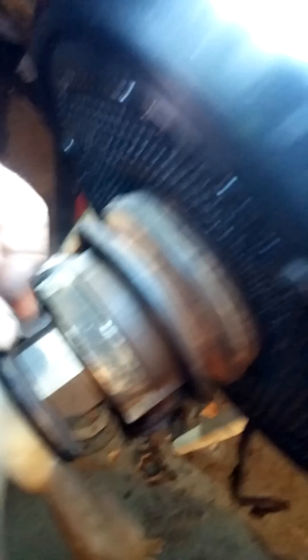This is how the assembly goes. Make sure that this washer here, right in the middle, rides on that ridge - because if that assembly does not move, your clutch will never work. Pull this out - you have some play in there. This is with the clutch rod pulled forward toward the front of the engine. Take the big nut and turn it with your wrench until there's just a very tiny bit of clearance - almost touching. The spec is two thousandths, so you turn the nut until there's almost two thousandths play in this area and that gap between the friction plate and the disc.